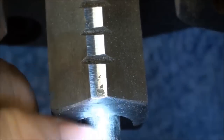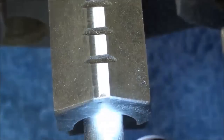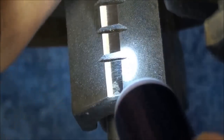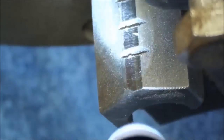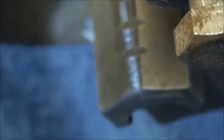This jaw has just a little bit of pitting here that I mentioned a moment ago. This one also has just a little spot there, but that isn't going to hurt a thing, because they really cleaned up all the way back. This one was probably the jaw that had the most removed from it, but it is totally cleaned up and looks really great. There's quite a bit of swarf and dirt on the inside of the chuck, so that's got to be cleaned thoroughly, and I know some of that got down into the scroll. So this chuck needs to be totally disassembled and washed with thinner.